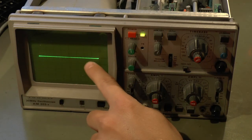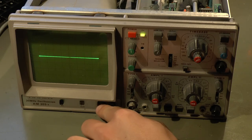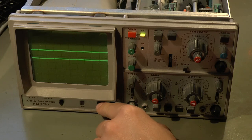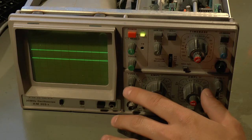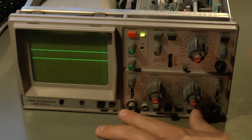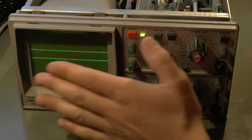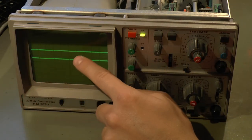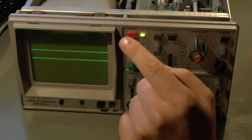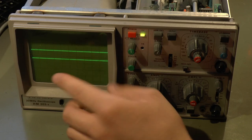With the intensity low you can see it's definitely a lot better than what we get on channel X and Y. That tells me the fault is not only somewhere beyond the front ends, but somewhere behind the front BNCs, and still in front of the main Y or X power amplifier. Which is good, because these old CRT oscilloscopes have some fairly high voltage components in them.